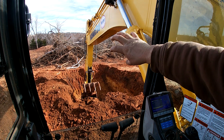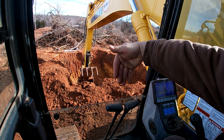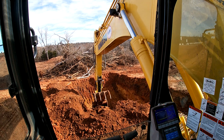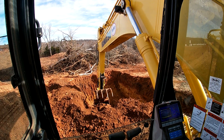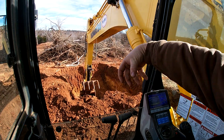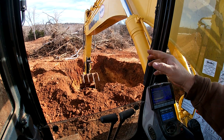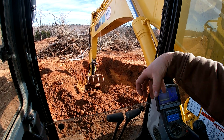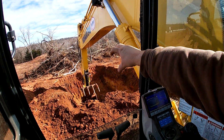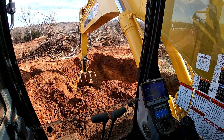Bearings are very important to protect. You've got to think about the angle of your bucket — just because you have teeth on there doesn't mean you're going to rip through everything. You can snap teeth off. Maybe I'll start a little Operating 101 for anybody who's curious. Just remember: when you've got a nice full bucket, keep it close to you so when you start turning, it's easier to start. And if something happens and you have to stop suddenly, there's a lot less mass. The mass you have is closer to you — because if it's way far away, there's a lot of momentum when you're trying to stop. All right, let's get back to work. Thanks for watching.